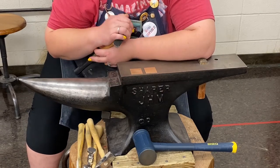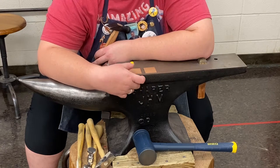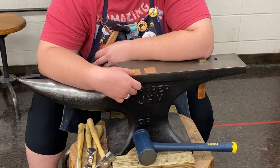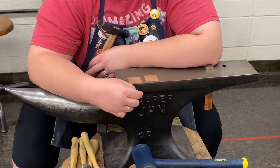It is also going to harden the metal. This metal is currently annealed — very bendy — but by the time I'm done it probably won't even lay flat anymore. So I'm definitely going to have to anneal it and flatten it before I can do anything else to it.